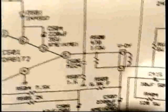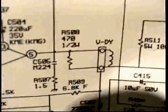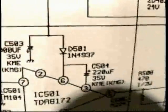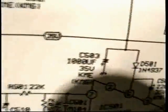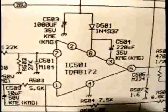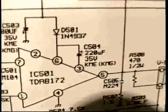Okay? Now, wake up, man, wake up. I'm going to tell you something that's so critically important. What I'm about to tell you solves the problem where this happens, and some of you have probably encountered this. You get to a monitor, you just have a horizontal line on the screen. You say to yourself, oh, I have bad vertical deflection. You do find that the vertical chip is bad because you replace it and you get your vertical deflection back. You go, yippee, I fixed it.